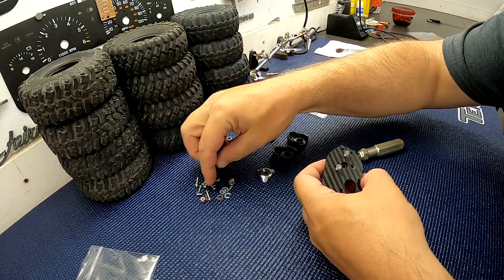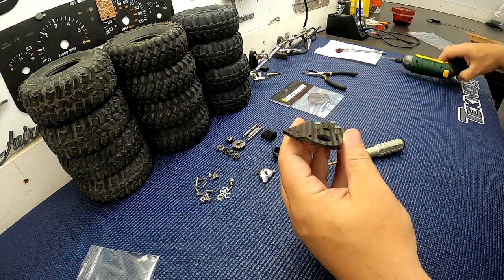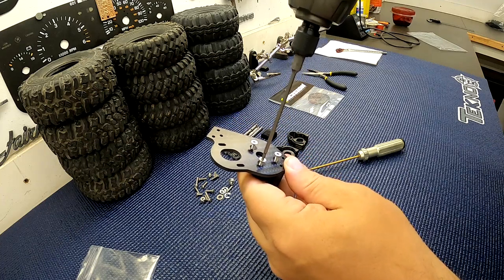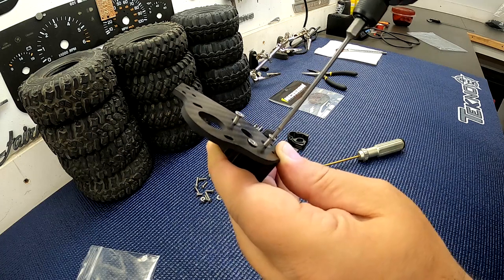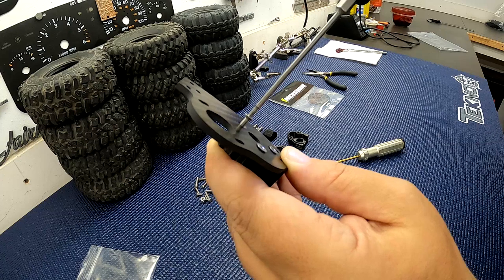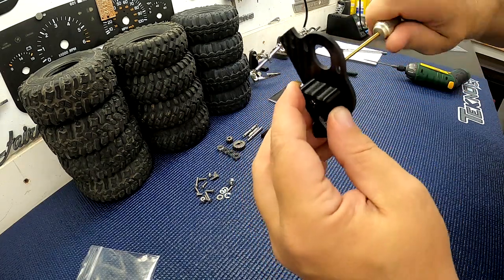Once you get these started, you can use your powered screwdriver to tighten them in — just a tiny little bit of grease in there. I use this Techbow I got off Amazon, about 25 bucks — it's a lower RPM screwdriver. You want to put those in almost tight. If it's a little crooked, restart it and make sure it's going straight. The worst thing you can do is use high RPM and no grease — all you're going to do is melt the plastic. It'll get too hot.